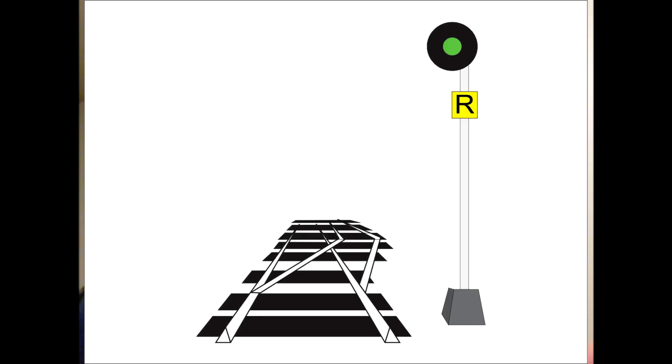The R-plate is sort of like our red lights on the multi-headed systems — it's a placeholder. You ignore it except when the signal is red. Basically, you look for the most permissive signal. The only signal the R-plate could possibly improve would be the stop signal, since all other signals allow you to go at track speed, which is faster than restricting speed. So the R-plate upgrades the red signal to a restricting signal; at all other times, it's ignored.